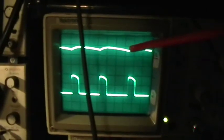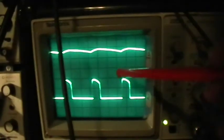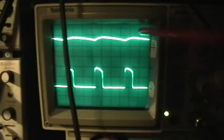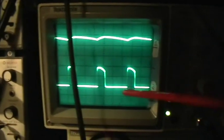So we're seeing slightly under one volt — that's a depleted button cell battery. At half a volt per division on the battery trace we're seeing those same dips, and the dips occur at the time when the LED is just turning on.